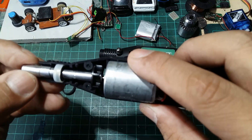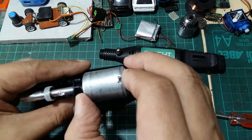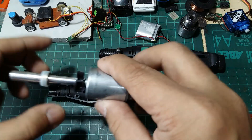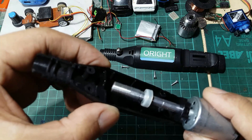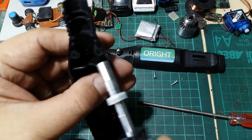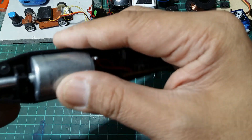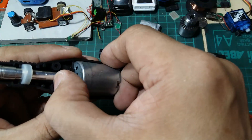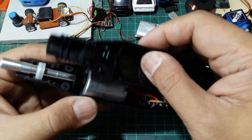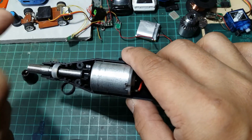There is a very long shaft going to the chuck. When you do grinding, the ball bearing holds the shaft firmly in its axis so there's no wobbling. There is also a small centrifugal fan right here, but I think it's not doing its job very well because the shell is covering the motor itself when both shell halves are together — so this fan is actually not practical and not doing anything. You can remove it if you want.